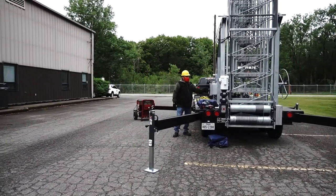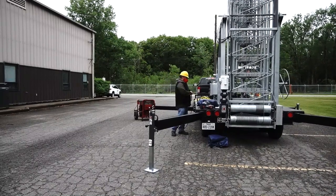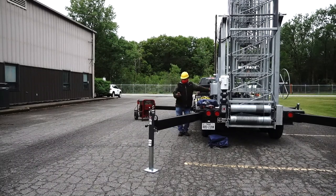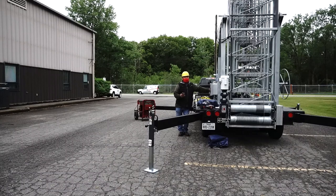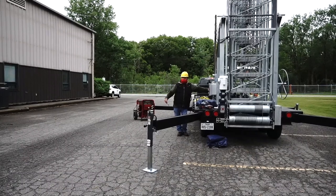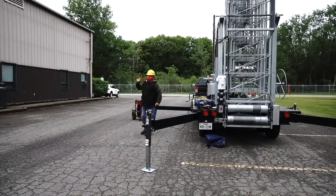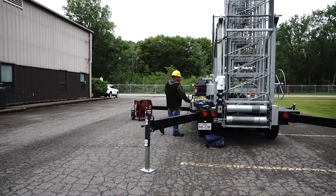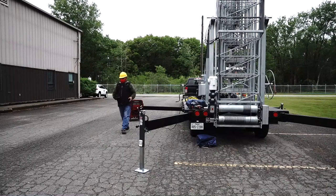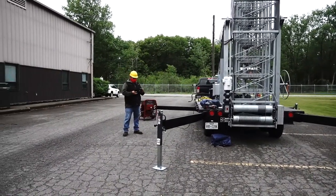And not only that, when I tilt the tower, I said before, and now everybody's here, but I said this: when you work with the tower, don't use the phone. Don't take selfies. You need to pay attention to your tower, especially when it's moving. And the other recommendation, when you move the tower, nobody stays on top of the trailer because it's moving, it's heavy equipment here.